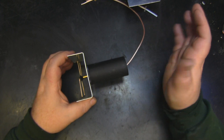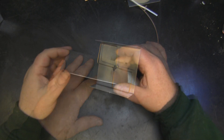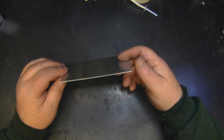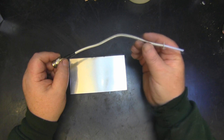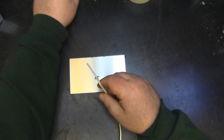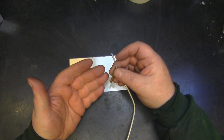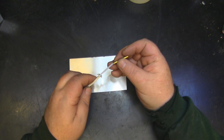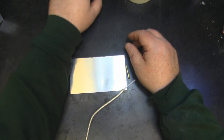Really simple tools — hopefully you'll be able to make a few of these yourself. I've got a piece of aluminium here measuring 130 millimeters by 75 millimeters, one millimeter thick, so it's easy to cold bend. I've got a pigtail with an N-type female on the end, the coax already stripped back. I've also got a piece of brass tubing, 30 millimeters long — that measurement has no bearing on frequency. The tubing is 4 millimeters in diameter and fits nicely over the top.